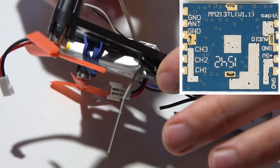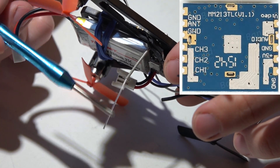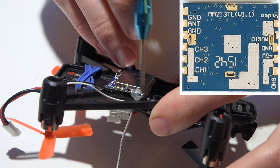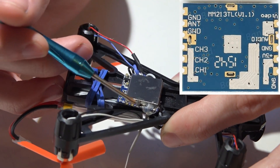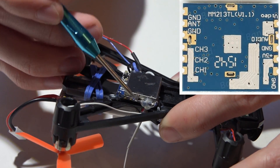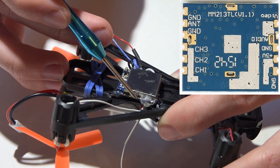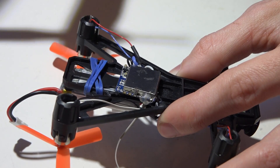The video transmitter comes with a linear polarized antenna but it is junk. I do have a video showing how you can make these yourself, and a DIY one works much better. You have your signal pin between two ground pins — your signal wire goes to that and your shielding wires go to both grounds on both sides. You have channels one, two, and three. You can place a dip switch on it but that's more weight. The other way to select channels is by soldering between the pad and the metal case to short it out — that's how you choose your frequency.